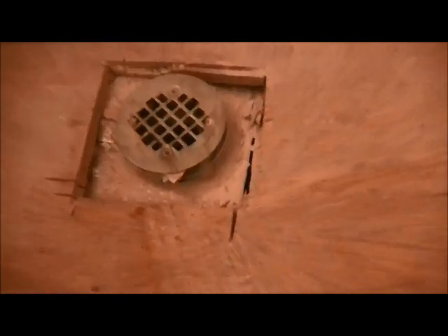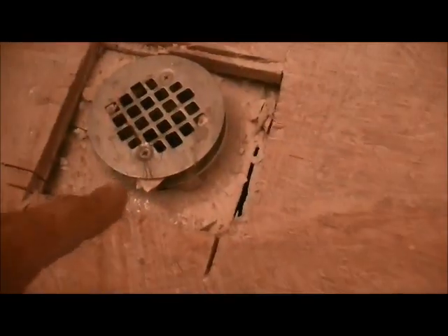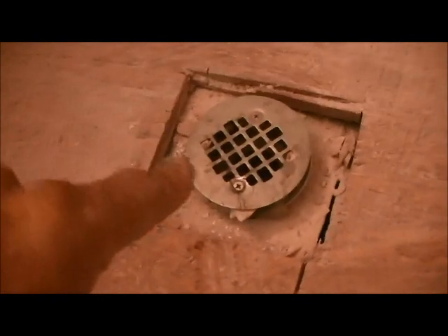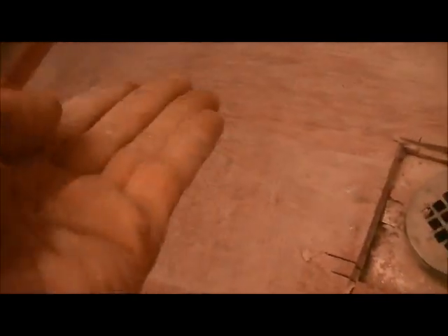The next step is to cut out a larger square to figure out where this drain is going - there's going to be a P-trap somewhere. Since the tub and vanity are in that direction, the drain is likely going that way and the P-trap will be here. Depending on what I see, I'll probably change out the P-trap where it bends. If I can't, I'll work with the same two-inch pipe, go a bit below grade, cut it off, put an extension piece in, and then install the new drain assembly. Then I'll be ready for the plumbing area, scab pieces, building up the curb, and putting in the shower pan liner.